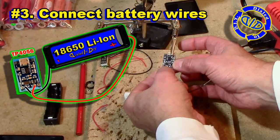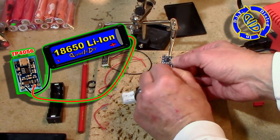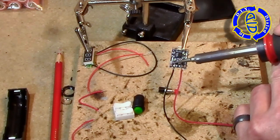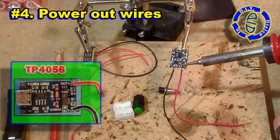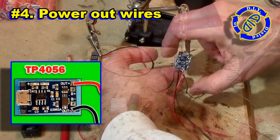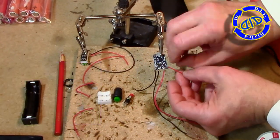This little charging chip that I'm using is actually really awesome, especially because I'm using this for cheap batteries. It has several functions. It's called a TP4056 chip, and it not only allows it to charge, but it protects it against overcharging and over-discharging when you're using it with these lithium-ion batteries. If you want to know more information about this chip, look in the description below, but I also did a previous video just on this chip because I use them in so many different projects. The best part is, you can actually pick these up online for less than $2 each.